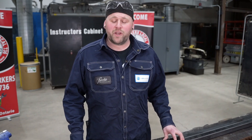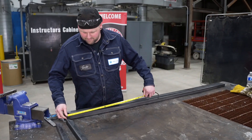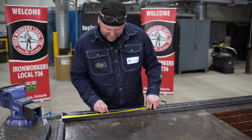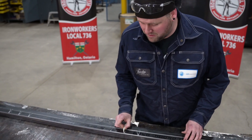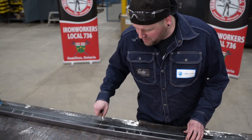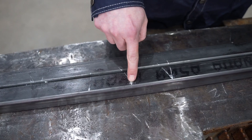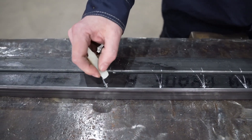Now that we have all of our parts made up, we're going to take the two outside members of our frame and mark out where the half-inch round bar is going to go. You may have noticed that I use two ticks when I make my marks — this way that gives me a fine point where my mark is actually supposed to be. If I put a straight line I'm not quite sure where I'm supposed to be, but if I make that point fine I know exactly where I'm supposed to be.